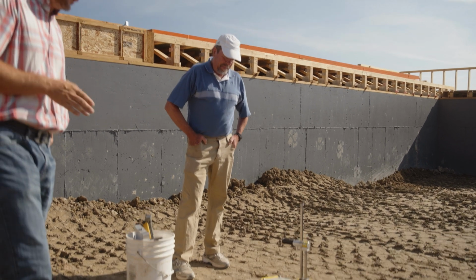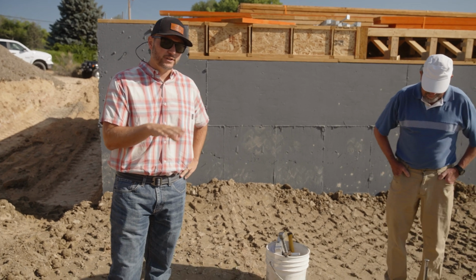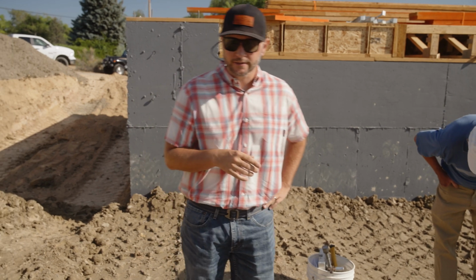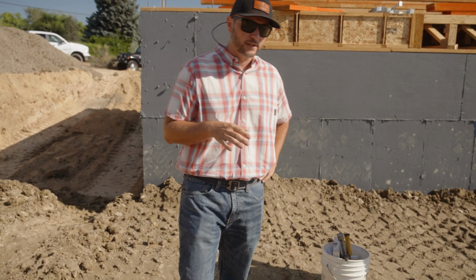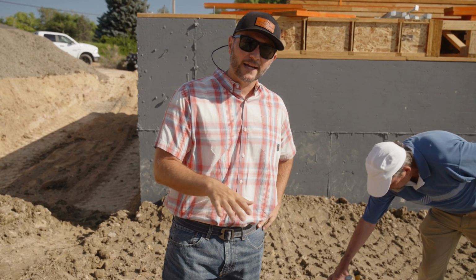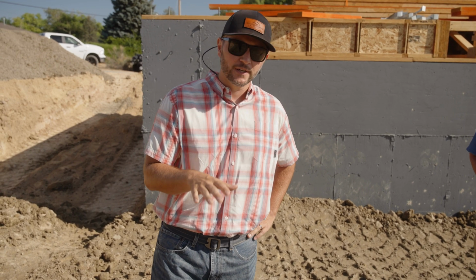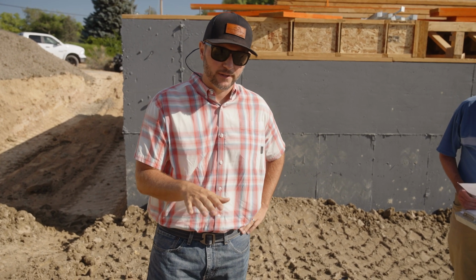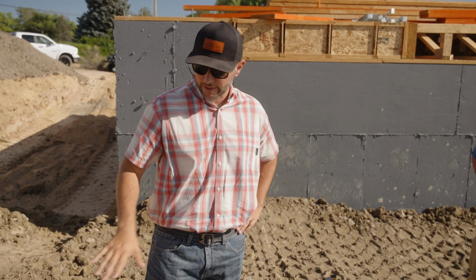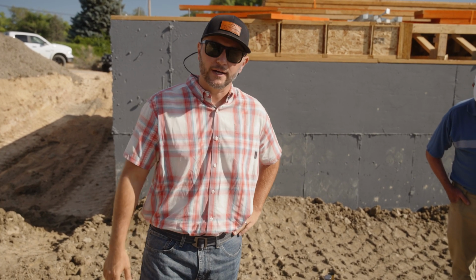So while we're waiting for that, basically what we're doing right now is we're bringing back this processed shale. So we've put moisture into it so it's at the right moisture content. Mr. Scoggins has done that. That's who's doing the excavation. So we're bringing that shale, which is a native material, back in. Basically, we've conditioned it and put it back in, like Martin had mentioned, at a compaction that fits his design. This is the second lift that you see here, this darker material. It's a little bit wet, which makes it compact really well.